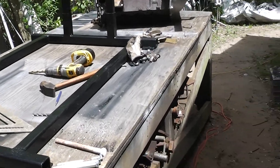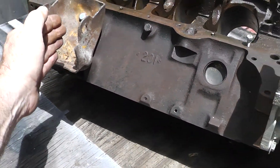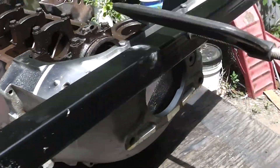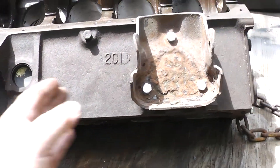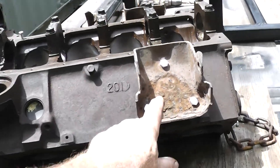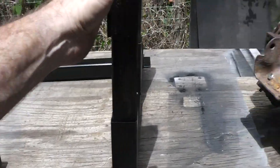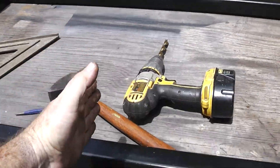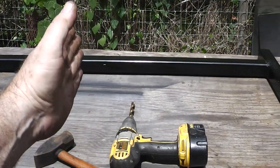She's starting to come together now. What I did is I measured the center here and I measured from here to here. I've got that C-clamped on there and that's 22 and 3/8ths. And the same thing from here — I measured from here to the center, 22 and 3/8ths. I need to figure out where the bell housing is going to bolt to this and then where exactly those motor mounts are going to line up here.